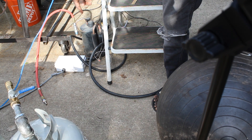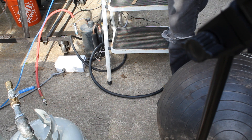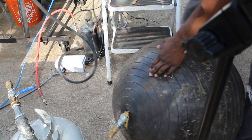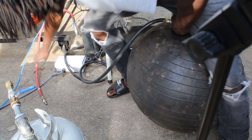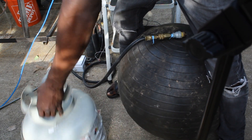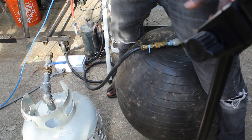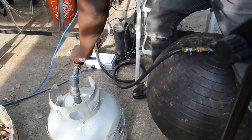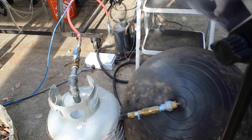What I have here is a compressor from an air conditioning unit — a window air conditioning unit. These get up to very high PSI. They have a vacuum side and a push side. I hook up the vacuum side to my yoga ball full of plastic natural gas, then hook up the push side into a modified propane tank. This is not recommended at home — once you get to this point where you are operating with flammable gases and high pressures, it definitely bridges the gap between straight-up danger and no longer being a DIY project.